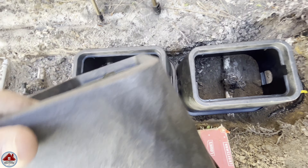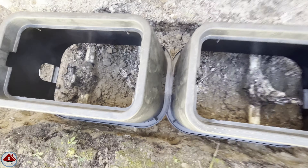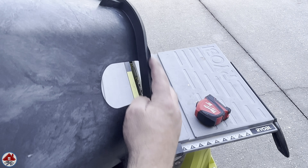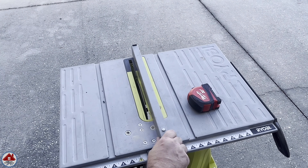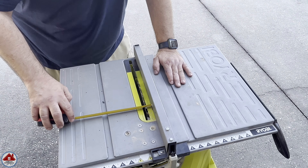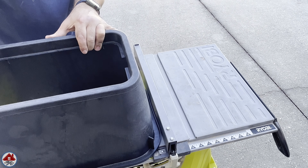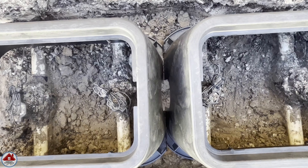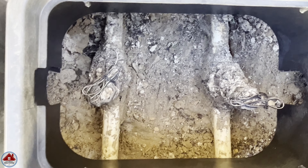Okay, valve boxes. I first tried a rectangular 12-by-17-inch one — it was almost large enough to encompass three valves but not quite. It wouldn't leave me enough room to work on the end valves, and the solenoid was literally sticking out of the box. Next I tried a rectangular 10-by-15-inch valve box — this size can encompass two sprinkler valves so I have to use three of them. This is working better, but after looking at it in place, I have an idea to get the two valves more centered within the boxes by cutting off the end part that sticks out. On my table saw with the blade tied to the fence, I cut it off, then continue and cut off the other three. I next adjust the fence to cut just the part of the box that sticks out — not the box itself. I move the box slowly and the saw cuts right through the plastic. Now see how the end of the boxes are touching and the two valves are more centered? I'm happy with how it came out.